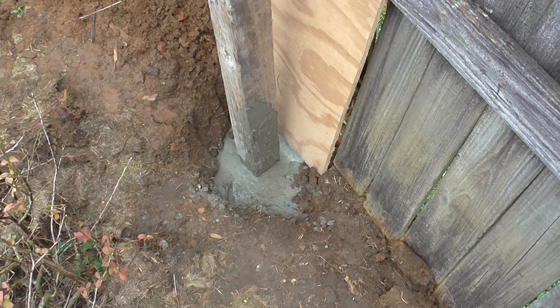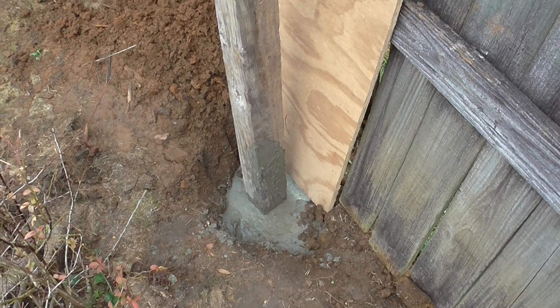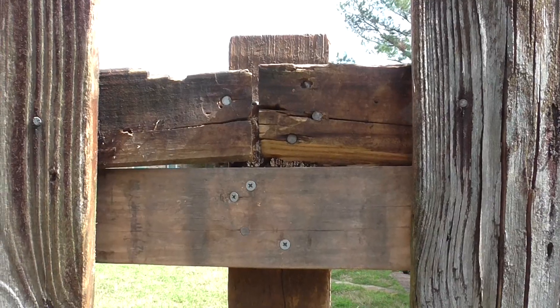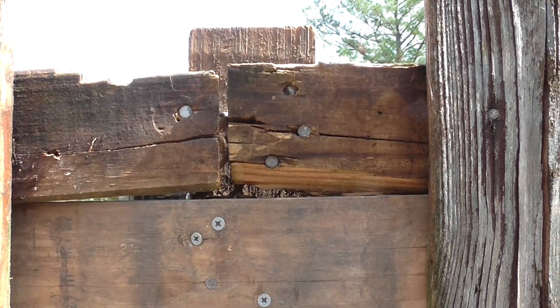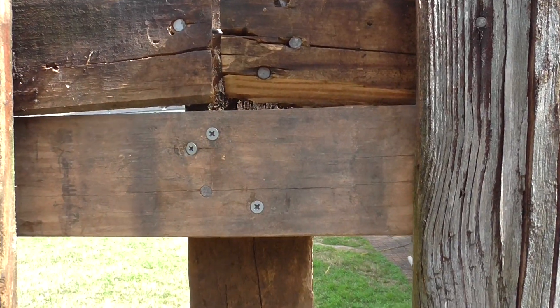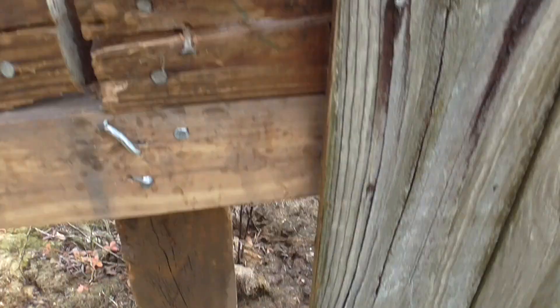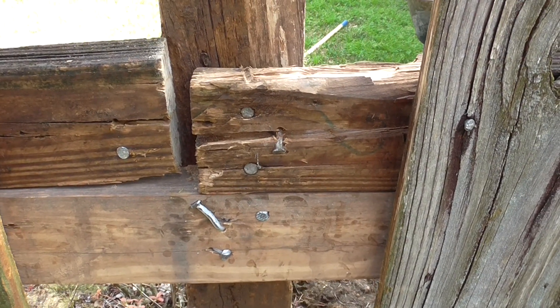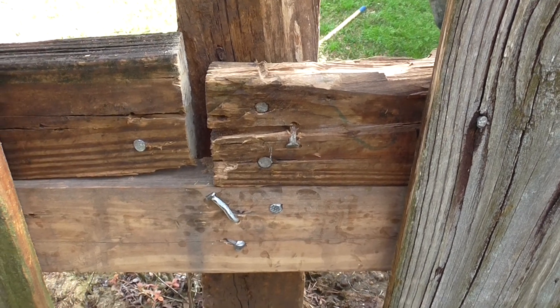Now the hole's concreted, we just have to let it cure overnight before we can finish this project. If your fence is old, your 2x4s may not be in great shape and you're going to have to have some splices to run across and prop the fence up and nail the fence boards in. It'll be fine once the boards are up.